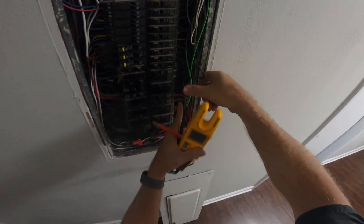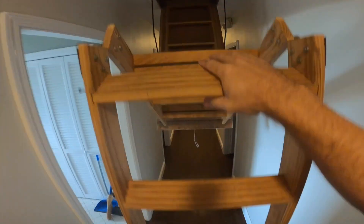Some people might just tape the wire green and use it for a ground, but technically you're not supposed to do that on anything six gauge wire or smaller. So I'm getting up in the attic because I thought it was conduit and I'm double checking. I find the conduit going to the box — it is in conduit. Then I'm checking for any junction boxes between the panel and my box to know if I can pull a wire. There are no junctions from my box all the way back to the panel.